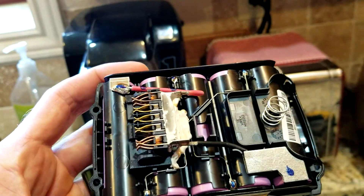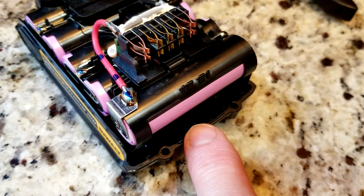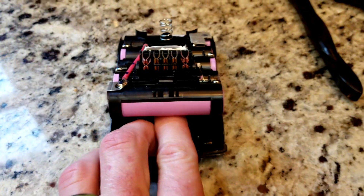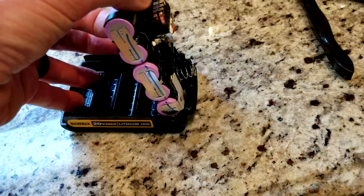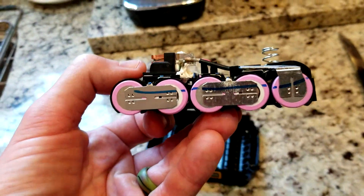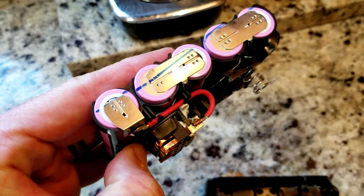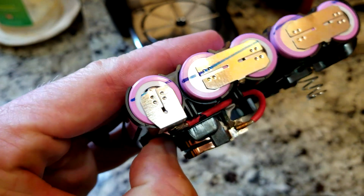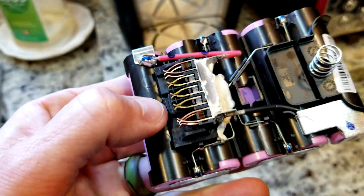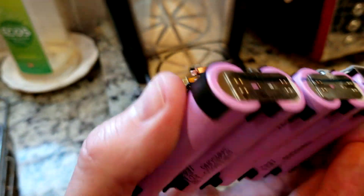It's going to be a bad cell, and it typically will show signs — or maybe not. Let's go a step further and pull this whole portion out of the bottom plastic. You can use a plastic putty knife, slip it in down here and gently raise it up — that brings out the whole cartridge of batteries. Do be careful because these are lithium-ion batteries; be careful touching metal to the prongs even though the battery might be dead.